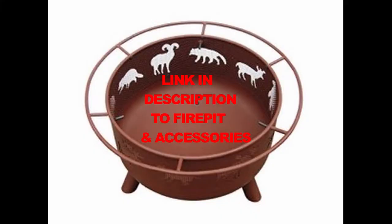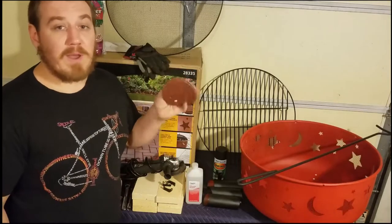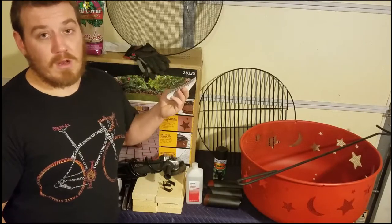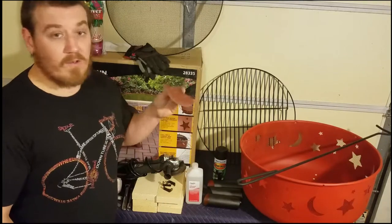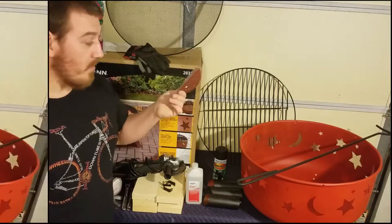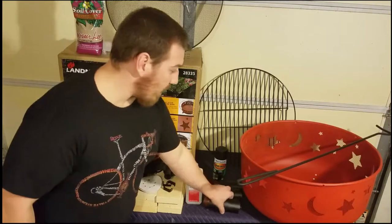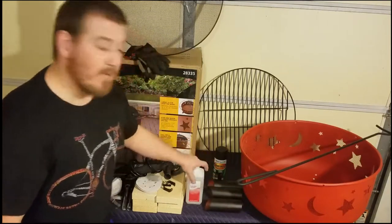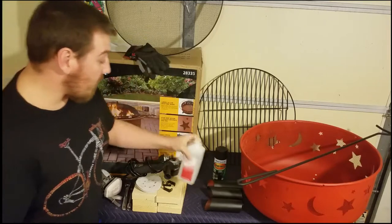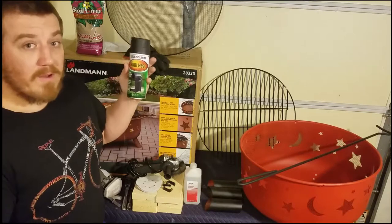As you can see, this is a Georgia clay color — you can also get it in black. The first thing I did was touch it up with sandpaper. If it's not good paint, it's not going to dry good, and of course it wasn't. I used 320 grit just to touch it up, going through about six pieces all over the body and the legs. Once I was done, I wiped it all down with alcohol, several passes until the paper towels started coming back more clear.